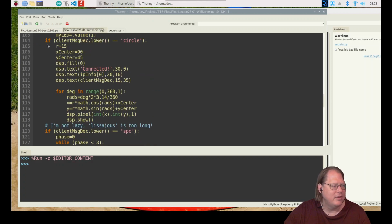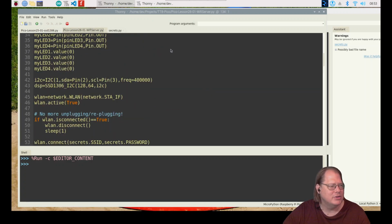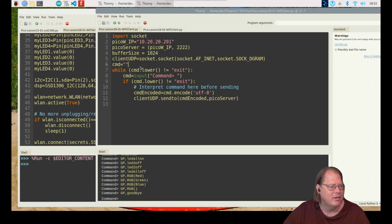Now, of course, as you can imagine, the Wi-Fi server program. Actually, before I do that, let's look at the Wi-Fi client. Generally speaking, when we're doing client-server type projects, you want to put the validation on the server side. There's a well-known set of vulnerabilities out there called cross-site scripting vulnerabilities. Maybe you've seen that in various patch notes. Well, what is a cross-site scripting vulnerability? Basically, by modifying the client that has been given to you, we can start to send bad data to the server, and because all the validation is on the client side, the server will accept it. So that's just generally bad design.